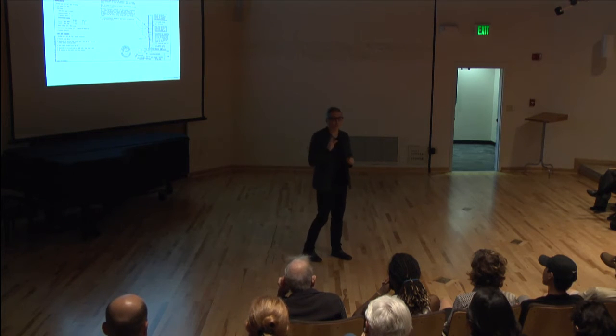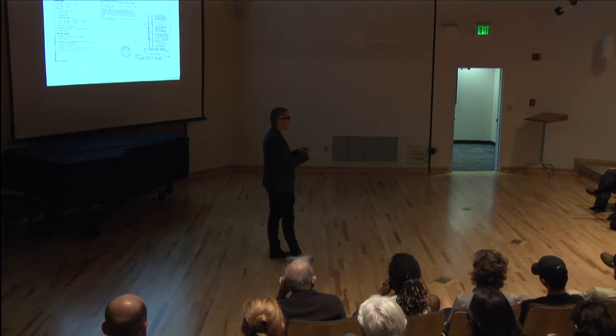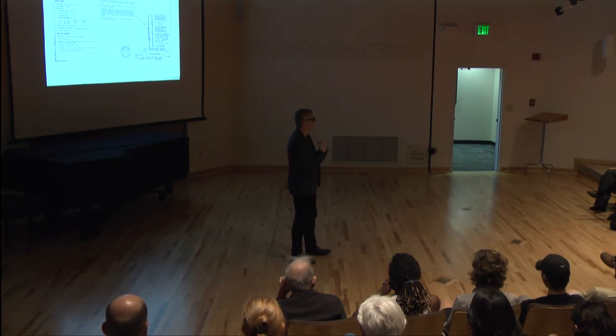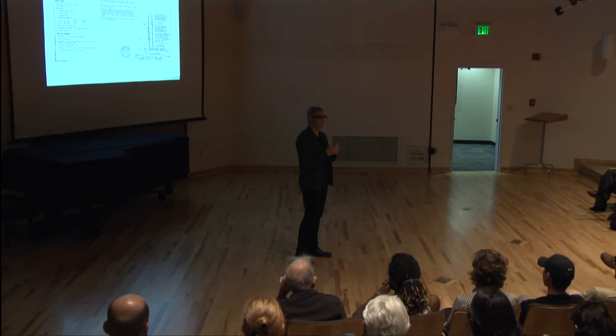We had to make sure that whatever we put on the wall is structurally capable of being put on there. For instance, you have a lot of wind here, apparently. You have a lot of snow, I heard. So these are factors that we need to take into consideration. Because if you put something out there that cantilevers 4 feet and snow comes on it, and there's wind deflection, you have to make sure that whatever you do is actually possible.